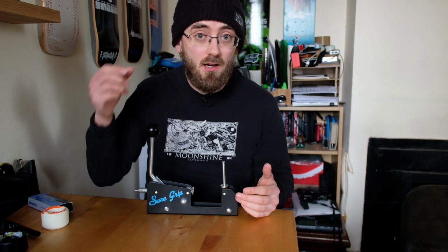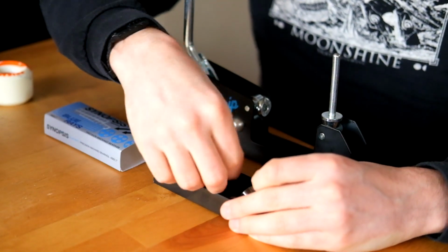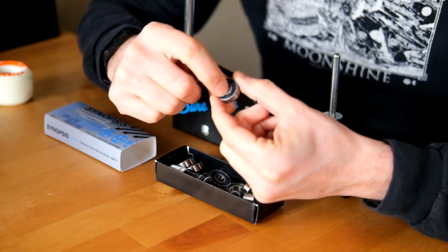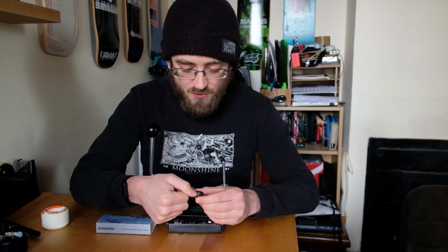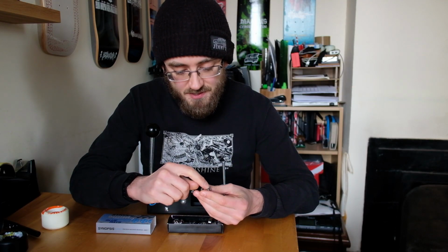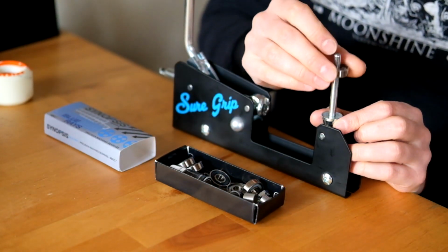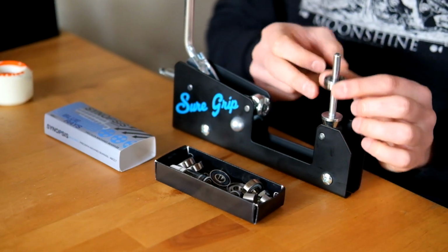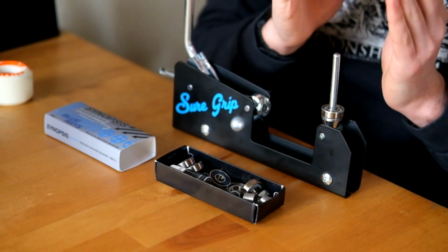When you push a bearing onto the axle, all you're really doing is contacting the inner ring, this section. Now, that's better than using your thumbs because you're not pushing the shield in. If the shield gets pushed in, then it contacts the ball bearings, the bearing slows down. But this has a large flange. So when you put the bearing on there, you're not just pushing on the inner ring, you're pushing on the outer one at the same time. You're pushing it in unison.